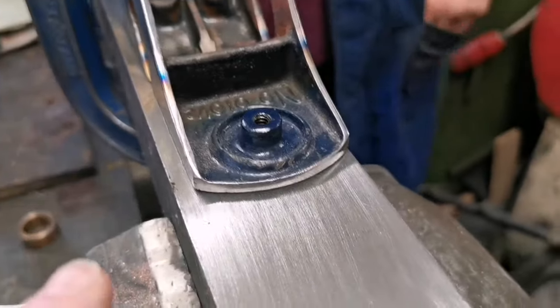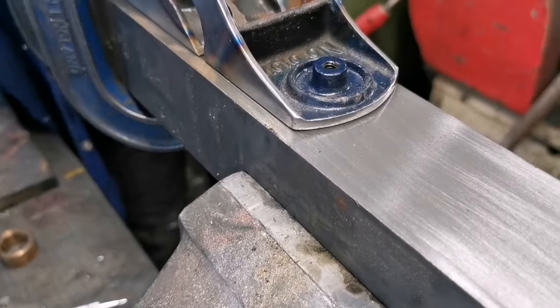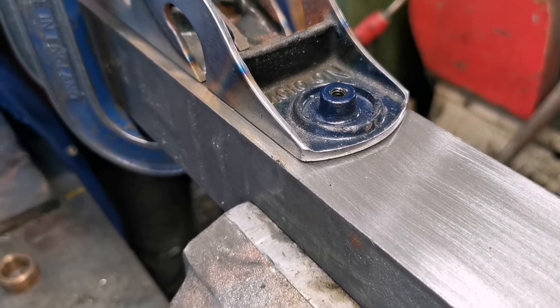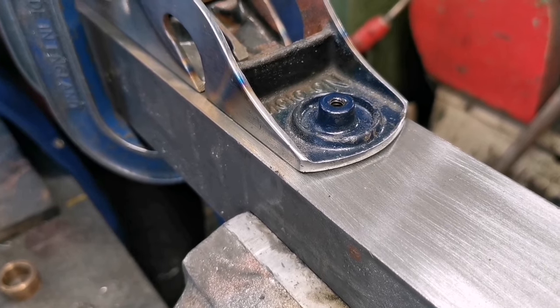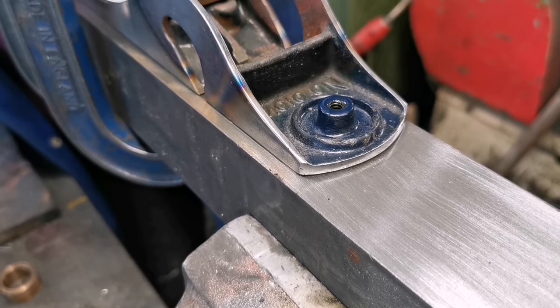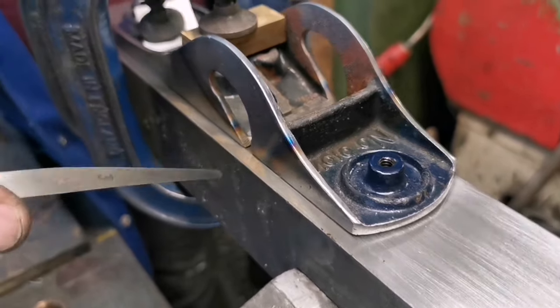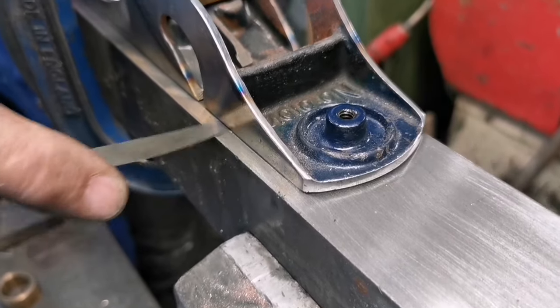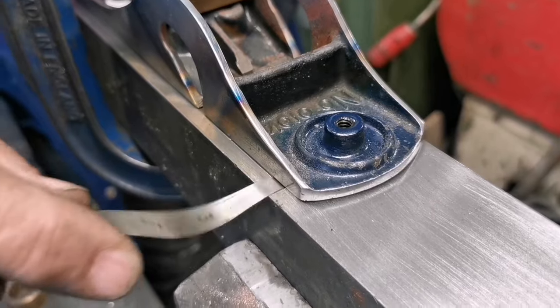Right, because the nose technically was 6 thou away from the surface. Now, hopefully, we shouldn't be able to get a 6 in. So we'll try a 3 to start. But there's 6 under the body, under the rest of the sole. Also, 3 is touching, just dragging on 3.